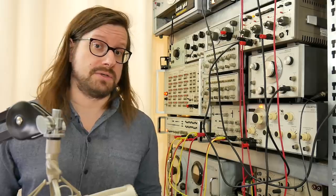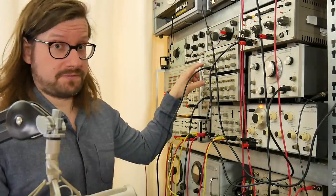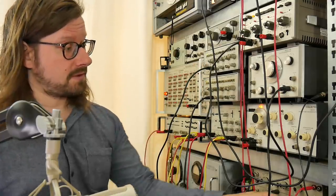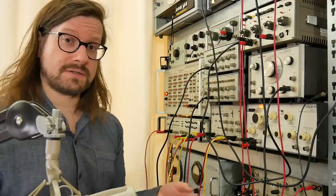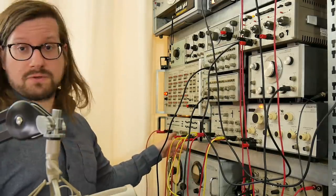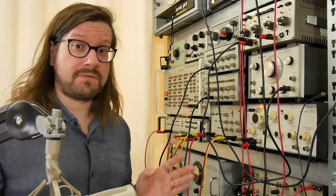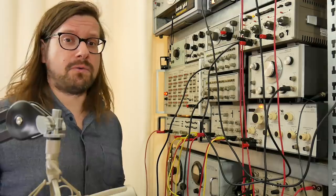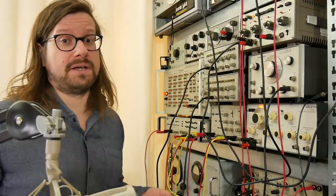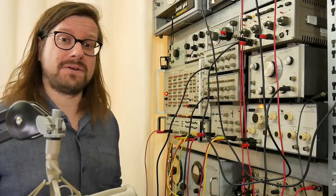For example, a switch, so you can do melodic switching. So now I'm taking two oscillators with different sounds and pitch, running them into a switch, and I'm changing between the two channels with the sync output, which makes them play together. And having stuff play together in test equipment, that's the difficult part, because there are no voltage-controlled amplifiers, as you find in a modular or any other standard synthesizer. So you have to find all these ways around that.